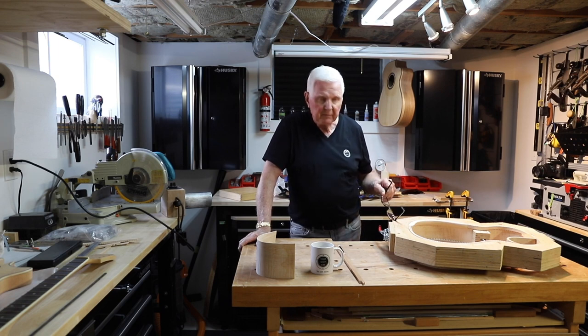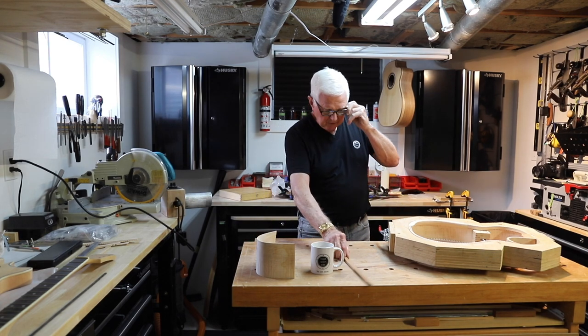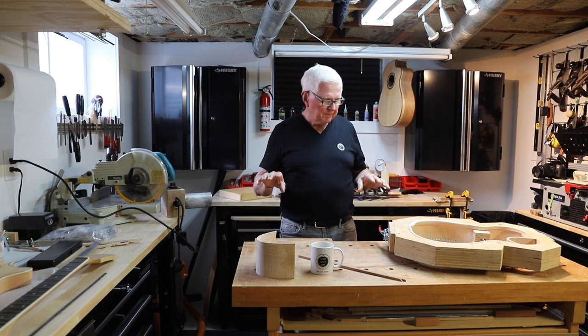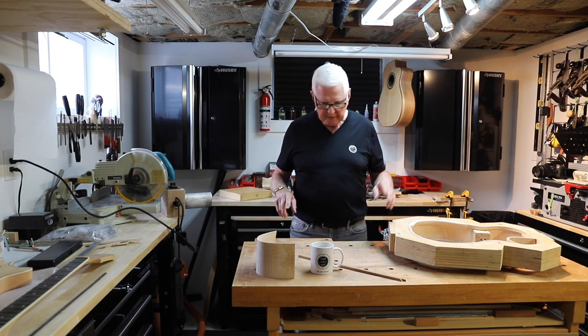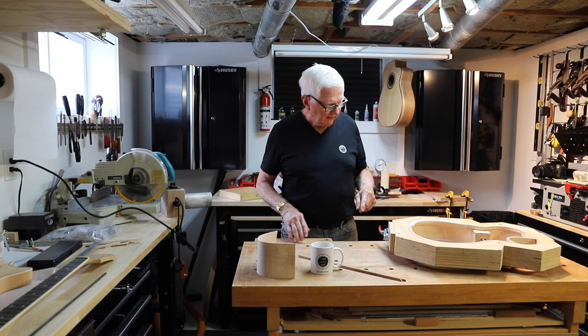What I'm going to do now is take the guitar out of the form so that it's handy. I'm going to work on it right here and measure for the bracing that we're going to cut on the band saw, and then we'll bring it back and I'll glue a piece or two in place. You'll see that, and then I'll end up bending this to make it fit the body. So let's do that right now.